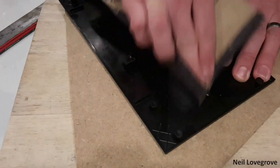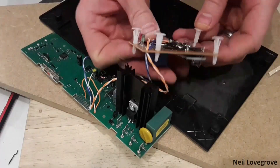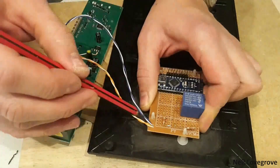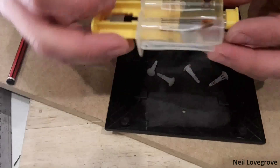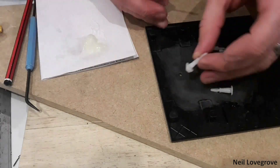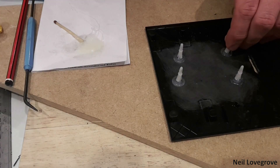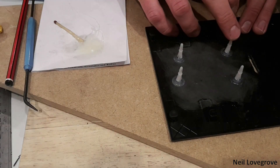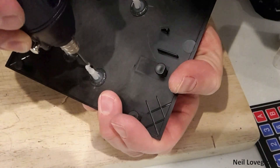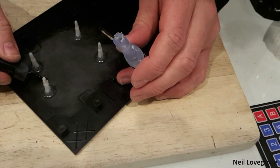After finishing the rod I roughed up the inside surface of the coffee machine side panel so I could glue some circuit board supports in place. I didn't want to see the back of the supports on the outside of the machine, so I marked up where they needed to go and stuck them in place with some two-part epoxy. Once dry, I ground off a little bit of material from around the hole so the acrylic rod would push in easily, then dabbed a little CA glue around it to keep it in place. I was quite pleased with the finished result.